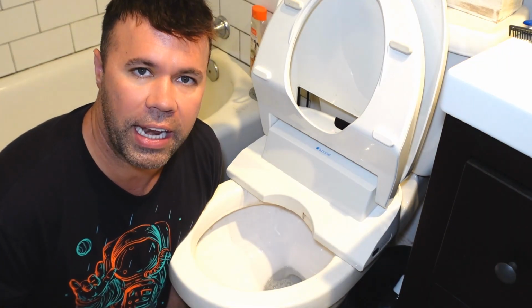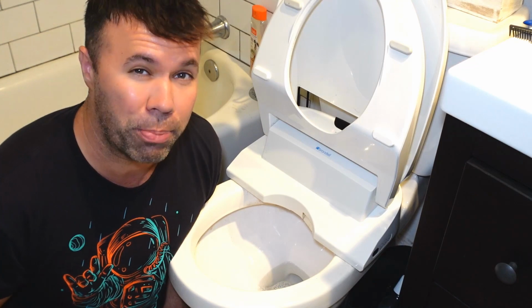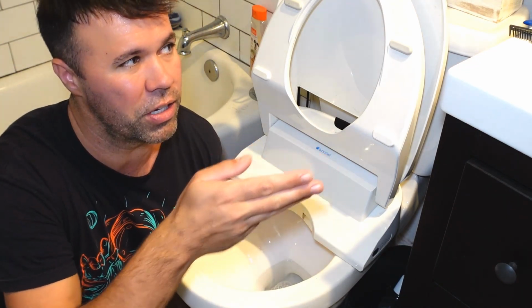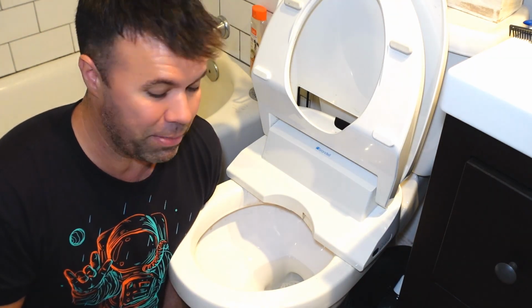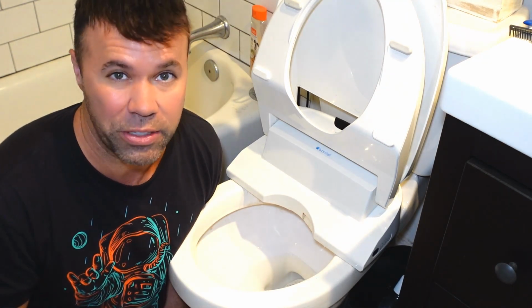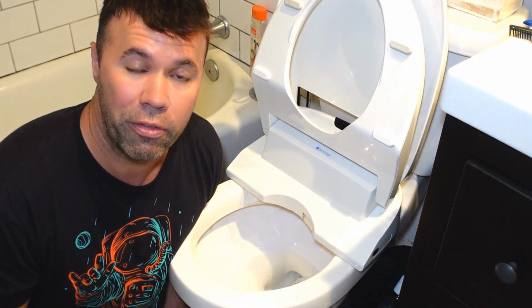Now, the other question I get asked a lot on my other videos is, can you use this remedy on bathroom sinks? I've never personally tried it, but I wouldn't think it would work because most of the time clogs on bathroom sinks are caused by shaved clippings from men's beards or things like that. And dish soap does not dissolve hair like it does toilet paper and waste or feces. So I wouldn't advise using this method on a bathroom sink, but maybe that'll be a video for the future on my channel.